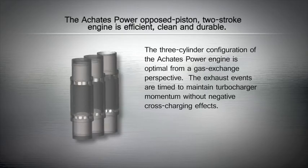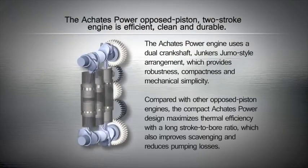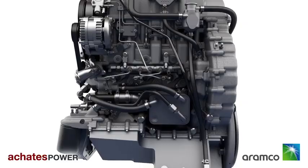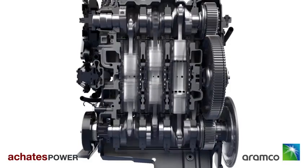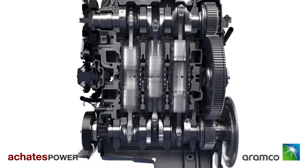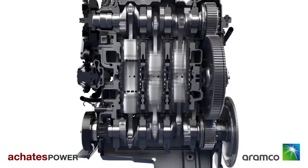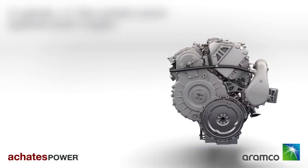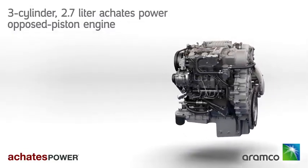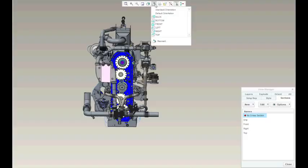The top pistons and bottom pistons each rotate an individual crankshaft, and these two crankshafts are then geared together to supply power to a single output shaft. Now, while having two crankshafts may seem like an additional complexity, this engine has no valve train, meaning no camshafts, rocker arms, valves, valve springs, and even no cylinder head. This particular engine we're looking at is the Achates Power 2.7-liter 3-cylinder engine, which is good for 270 horsepower and 480 pound-feet of torque. What makes this design efficient?